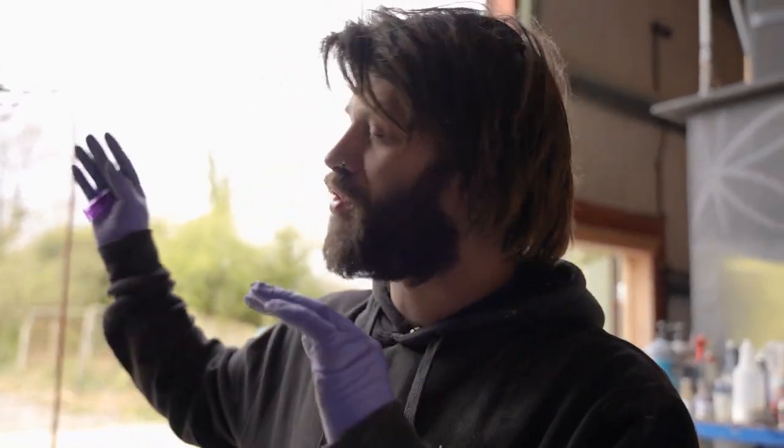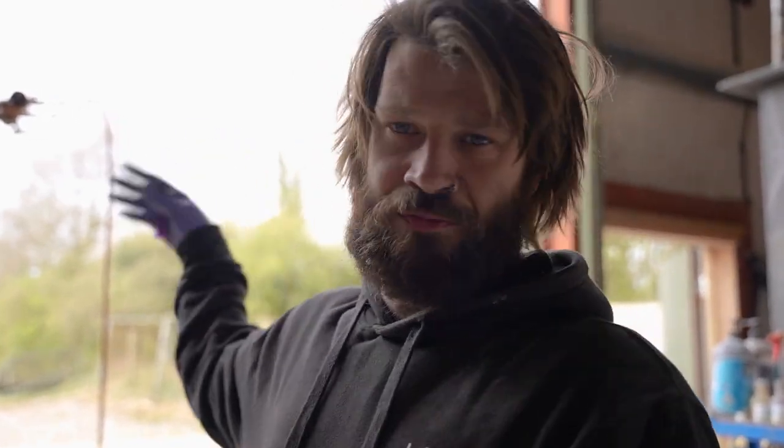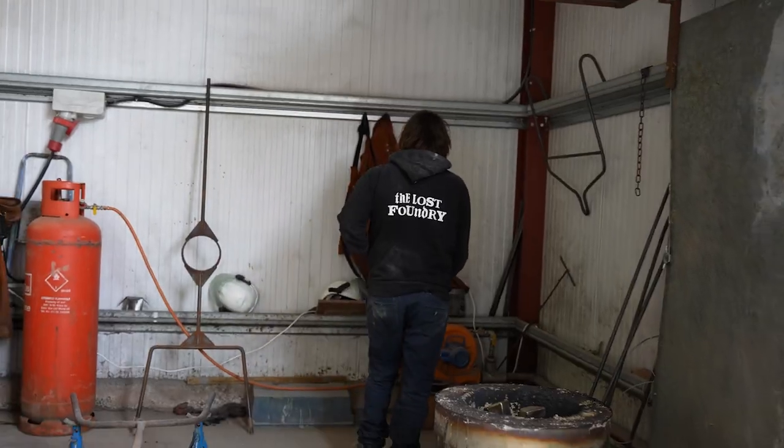As I said in previous videos, just put one on for a minute, let the heat get in. Let the heat find its way out so that it's got a lovely journey of heat going from top to bottom. Put too much energy in there, it blows back and puts the burners out, and you're spunking gas everywhere, which isn't great. So we're just going to put one burner on, get it nice and hot, and then we'll stick the second burner on, get them up to temperature. But for now, I'm going to go stick the furnace on and get that puppy roaring.